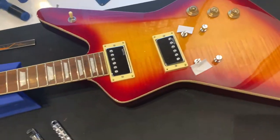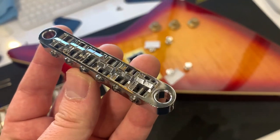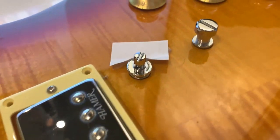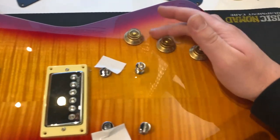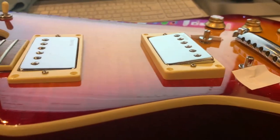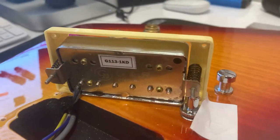Another pleasant surprise: I was expecting China-made hardware, but it isn't — it's made in Korea. It has a metric tailpiece and a tune-o-matic bridge which is screwdriver-adjustable. Nothing surprising with the controls layout: two separate volumes for the two pickups, a master tone, and a three-way toggle switch — which is the one thing I would replace in this guitar. It's pretty bad. The pickup rings come in a beautiful cream color that matches the binding and they are slanted. Removing the pickups, first surprise: I did not expect the cavities to be painted with shielding paint — both of them.